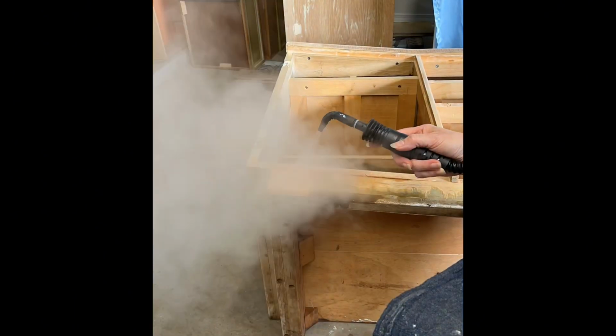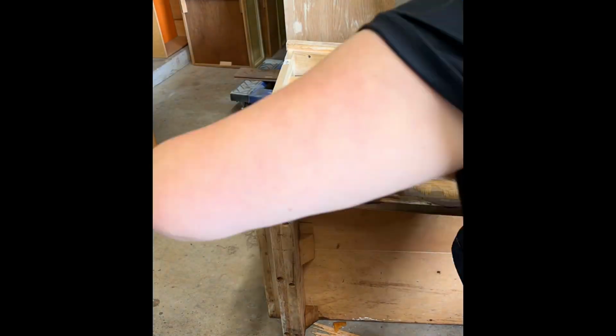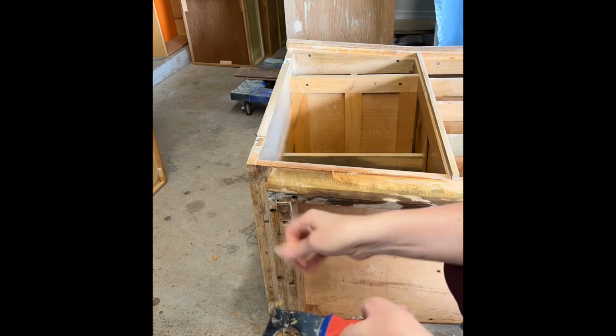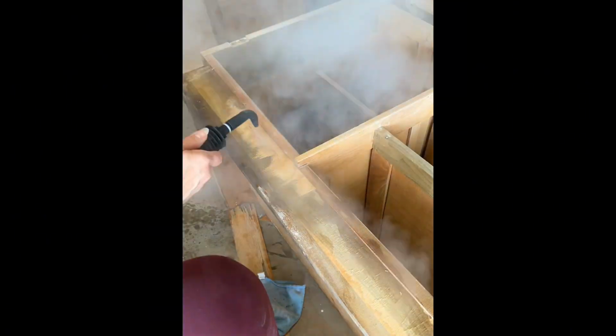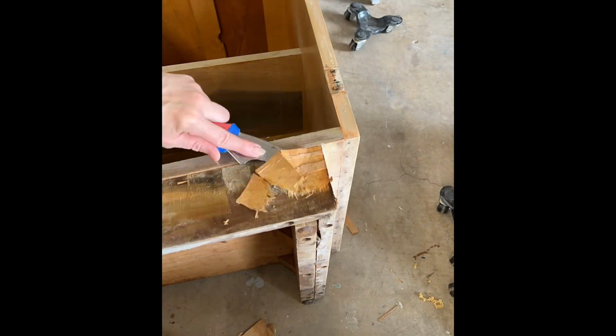So now I'm going to use my steamer to get the remaining bits off of the base. This little steamer is just, I'll have it linked in the description, but it's surprising how often I use it. I use it to loosen veneer. I use it to loosen the joints on drawers if I have to repair them. So it removes glue. It can remove Bondo.